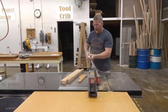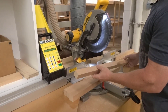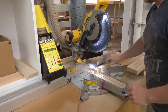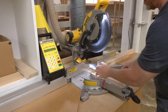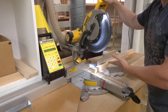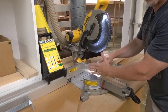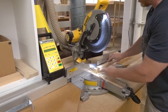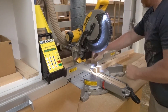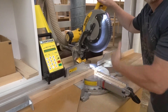Now that I have my blocks cut to the correct square size width-wise, we need to cut them to length. We're going to cut them down to 25 and a quarter — 25 and a quarter plus the three-quarter top will give us our 26. So set this to 25.25, 25 and a quarter. You can do it on either saw; they both work the same way. First I need to trim an end because I have no idea if this cut is square — it could be a little off kilter since it was rough when I cut it. So I'm just going to trim a blade-width or so off this end, throw it away. Now that this end is square, I slide it down and cut the other end to the correct length. Repeat on all four pieces.